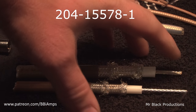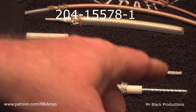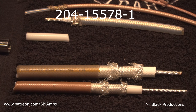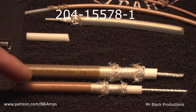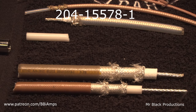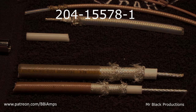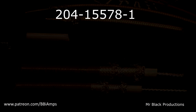So that means you have to trim off about four of those little strands — I don't care, that many strands versus that many strands. From the datasheets that I can find, this coax shares all the electrical principles of the 393. It's the same capacitance, same velocity, same loss factor — same and same. It's bigger, which means more insulation, more strands, more capability. Does that make sense?